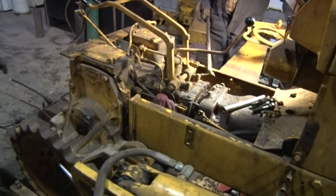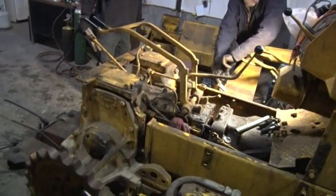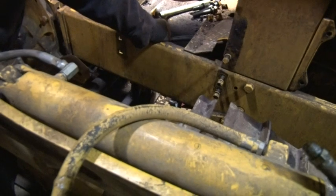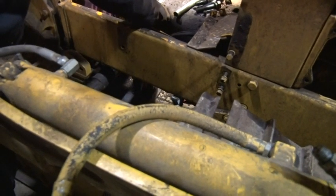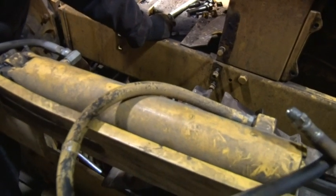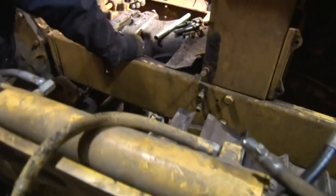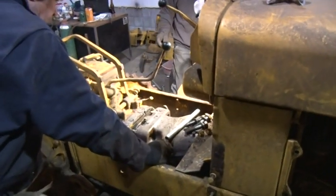Yeah, we gotta jack it into that transmission. Okay. What are you saying? You want to set it right down inside there on the floor, and I'll get it. There may not be a motor mount here in the back to support that bell housing in the back of the motor, which makes sense. We only gotta come up a half inch off that carriage. Now the transmission input shaft is offset. Yep. That's weird how they done that, unless there's a gear reduction in this bell housing.